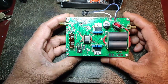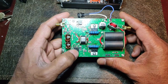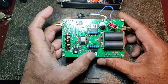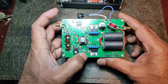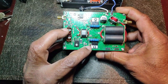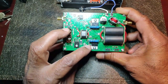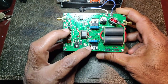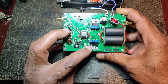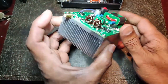The best gain is at 40 meters, 7 MHz, but it's usable on the other bands. It uses a 2SC3950 as the driver — the pre-driver I'm not sure about. Then there are two IRF530s in push-pull. I believe these are the temperature regulator diodes, and importantly they are mounted very close to the tab of the MOSFET, unlike some designs where the diode is elsewhere and can't sense heat variation. It is well mounted to the heatsink, which it comes with.